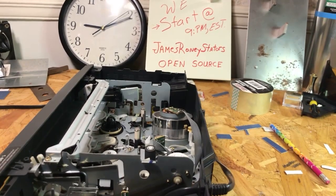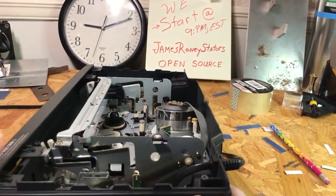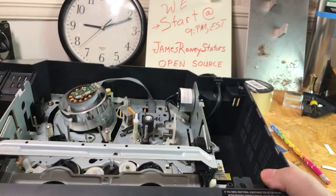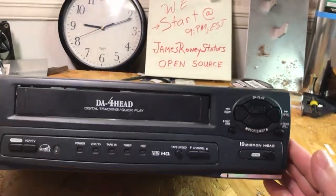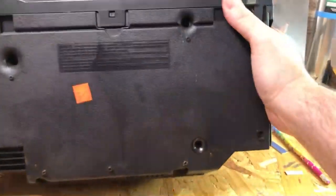What I have had to learn in my early stages of this is how to time the pulse. Just go online and buy yourself a reed switch, R-E-E-D, reed switch, magnetic reed switch. Now there's another way to do it. I'm not going to explain it. It's very crude, but there's another way to do it. So that means each time the wheel comes around to the precise spot, it'll fire off your capacitor. It'll discharge your capacitor and put it back into the system. Okay, what else we got here going on?